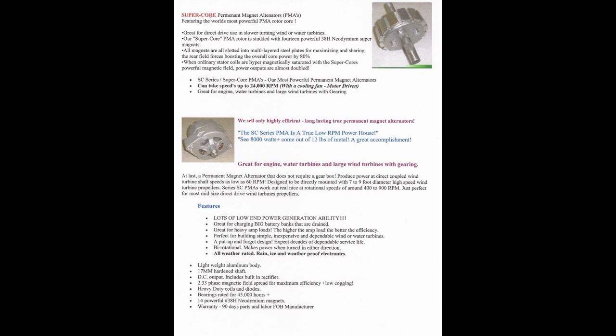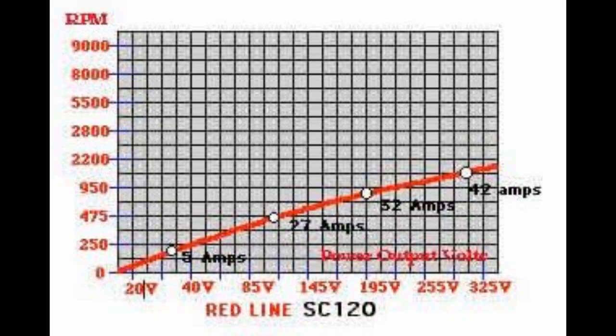Because I'm in the worst spot ever for a wind generator, I needed something that was able to run at really low speeds. A regular car alternator needs high RPMs to generate any kind of usable power, so I had to go to a permanent magnet alternator which can create much more power at lower speeds. This unit is advertised to generate power as low as 60 RPM, and its intended operating range is between 400 and 900 RPM. It's a little more money but I didn't need any gearing or belts — it's just directly coupled to the shaft.